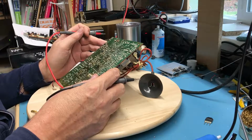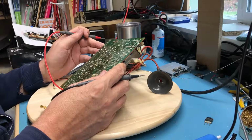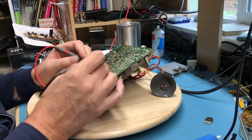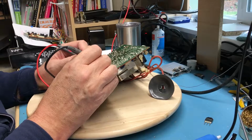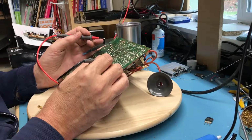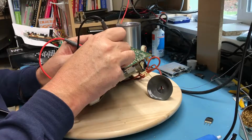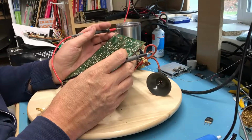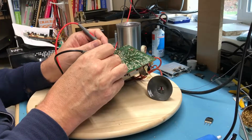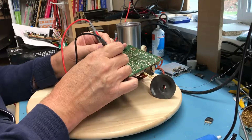I've got a lot of glare here. It's a connector. Capacitor, resistors, ferrite bead. Diode here I don't think I've looked at. He looks fine. That's a potentiometer. There's a Zener diode sitting here. It acts like a diode, so I'm going to assume it's good. There's another diode right here. Got a good forward voltage. Open the other direction, which is good. There's a diode here: 0.598 forward. Open reverse.